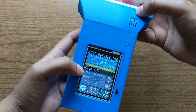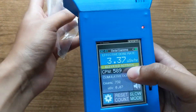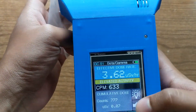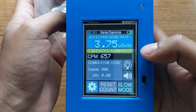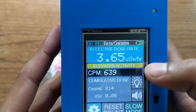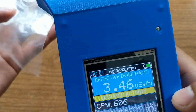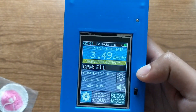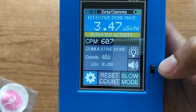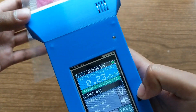You may have noticed that the counts keep rising and aren't leveling off yet, and that's because the count per minute is calculated by taking the rolling sum of the last 60 seconds. 60 seconds is a good integration time if you're measuring low levels of radiation like natural background — that's quite accurate. But if you're measuring a source with high activity or you want to see how quickly radiation levels change, you'll want to switch it to fast mode, which changes the integration time to just 3 seconds instead of 60.